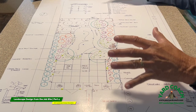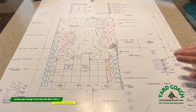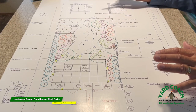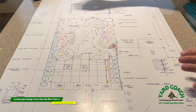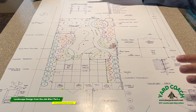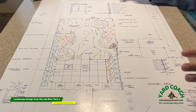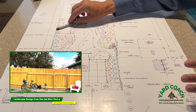Maestro is going to show you the angles as we go. Coming from the front yard, I have a lot of planting and structural detail drawn out so that the DIY client can look at it and understand — for example, what an arbor is, what a gated arbor is. The detail shows four-by-four-by-ten posts two feet in the ground, concreted; gates are three feet apiece; and the top arbor uses two-by-sixes and two-by-fours on end. There's your arbor.